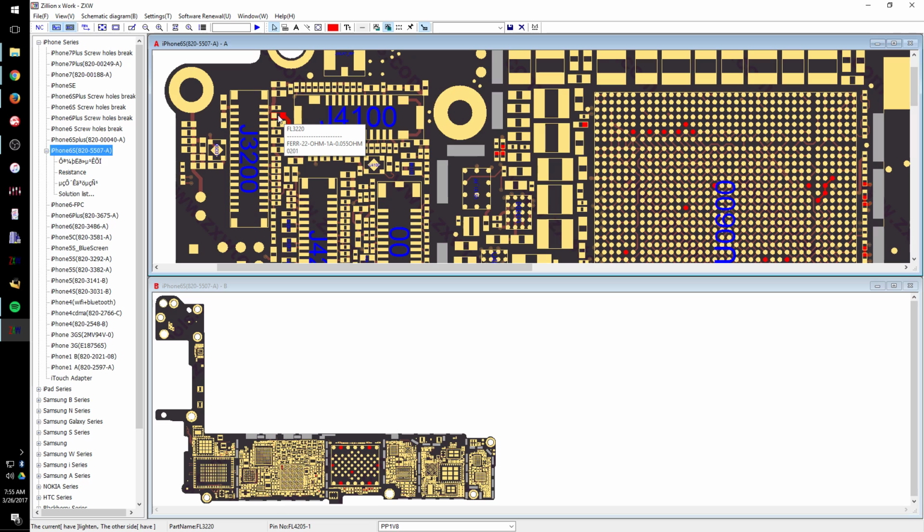So let's see, is there any chance that in changing this connector, I created some sort of a short to ground? There's always a chance of that. So I'm just digging these components out of the underfill to make sure. I've only seen it happen a few times, but I have seen it happen. Solder will travel across the top and just make like a layer when you heat these guys up without picking the crap off of them first. Doesn't look like that's the case here, but it is always a possibility.